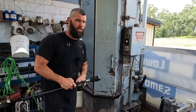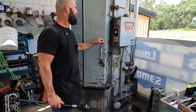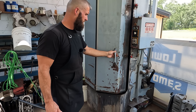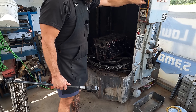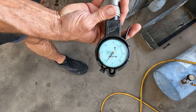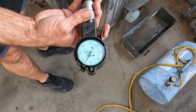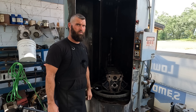It's been running a while and I've double confirmed the gauge is good. So we're going to stop it here, give it just a second to settle down, and then measure it at temperature. So that's about a thousandths and two, three tenths give or take — that's a thousandths and a half. So what that tells us is the aluminum is growing a half a thousandths more than iron.